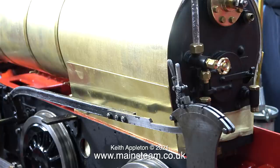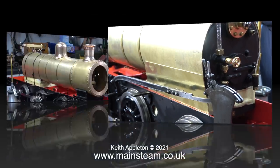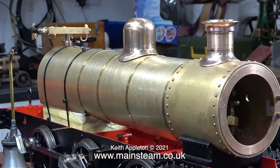These two small brass plates, made from the same material as the cladding, are a tight fit at either side. I'm going to drill some holes in the frames and use countersunk bolts from the inside with nuts on the outside to secure the plates onto the frames. Then I will very carefully drill the plates and cladding at the top, thread the cladding to something like 8BA — which is a very fine thread — and attach the two plates to the cladding at each side, which will hold the boiler firmly to the frames.